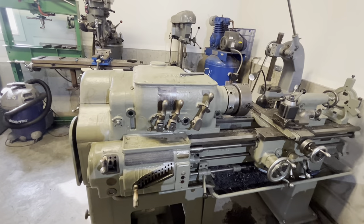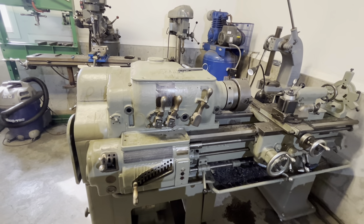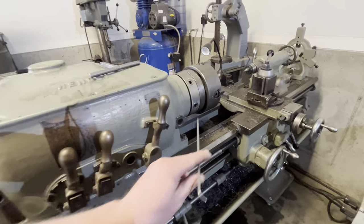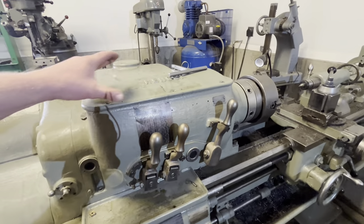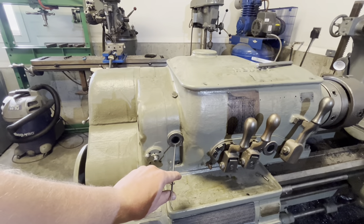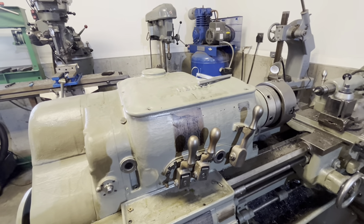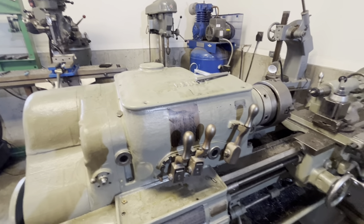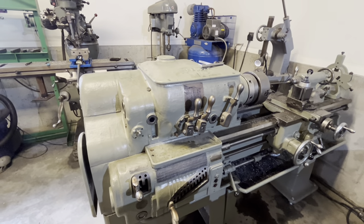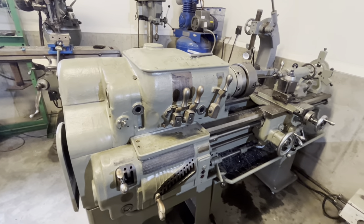Let's start with the main headstock area. The headstock has a front bearing reservoir, the main gear change area reservoir, and the rear bearing reservoir. I run an ISO 46 hydraulic transmission fluid in these reservoirs — it's called a Hi-Tran — and you can get it at Tractor Supply or any farm store.